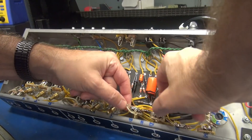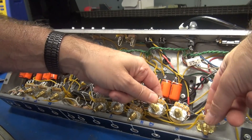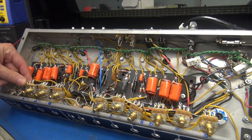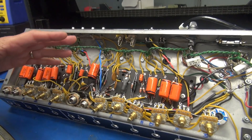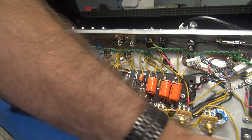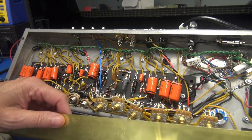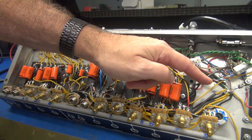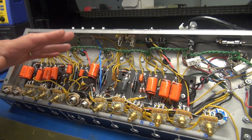Getting close here. One thing I really like about these kits is that Mojotone put in top quality CTS pots — quite the investment in itself — and Switchcraft jacks. This is all good stuff. There's just one missing piece, and that is proper ground bonding. That is why Fender did this. They struggled with this problem and came up with this solution. You put the plate in, your preamp grounds go to the plate, your power supply grounds end up over here, which separates that current from this current and reduces the noise level.